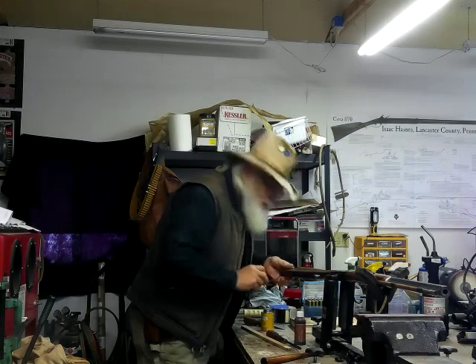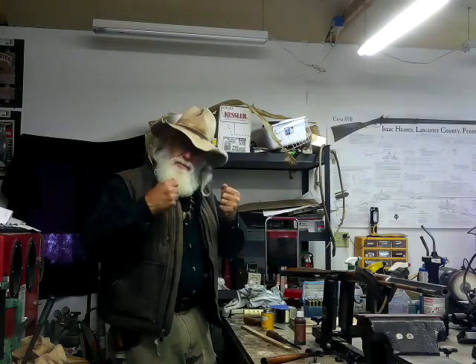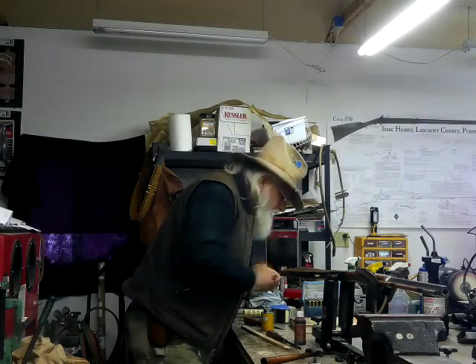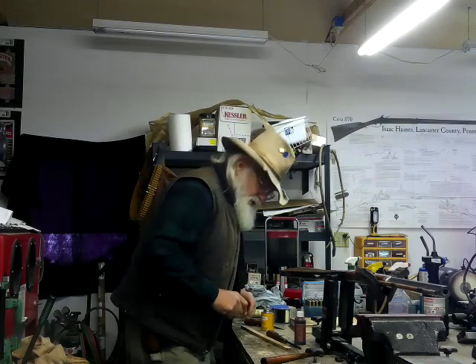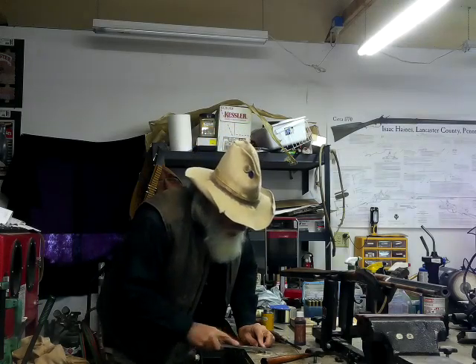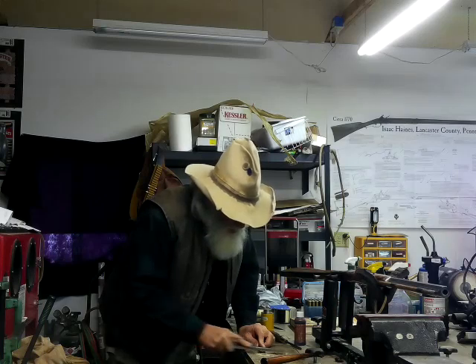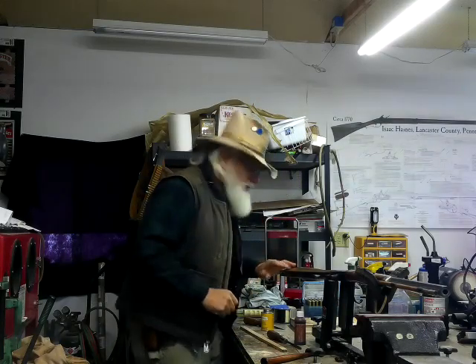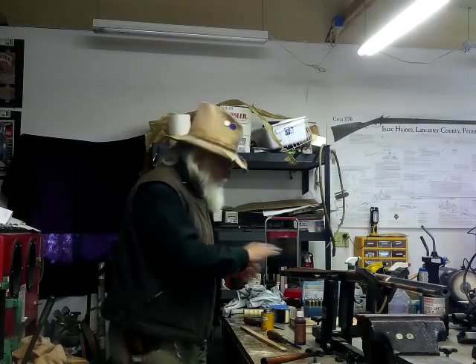Sometimes when stuff cracks and you glue it together, it's a perfect fit back. But sometimes when the stock cracks, you don't get all your wood back — so when you put it back, the piece that might be missing shows. That seems to be what's happened here. So what I've done: I got a piece of curly maple, because this is curly maple, and I've done a little bit of sawdust. The first time I packed the sawdust in that crack. Now you want it to stay in there, but you can't glue it, because if you glue it you'll never be able to color it so that it matches the surrounding area.